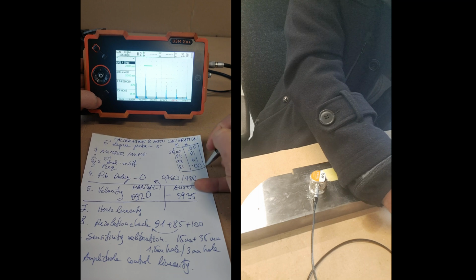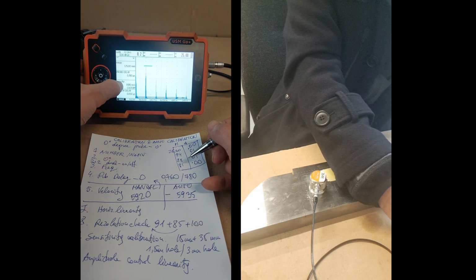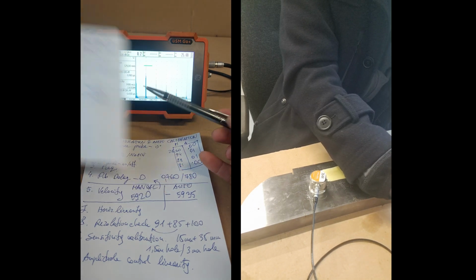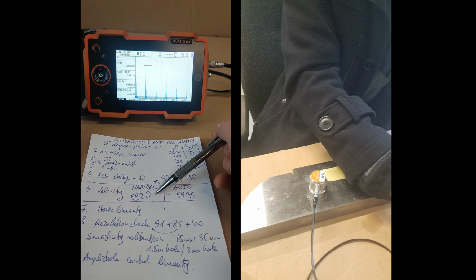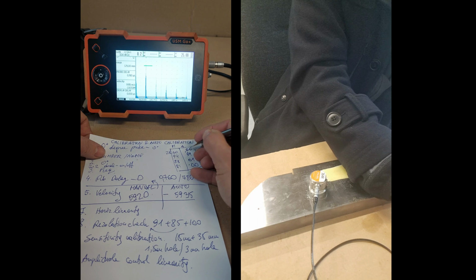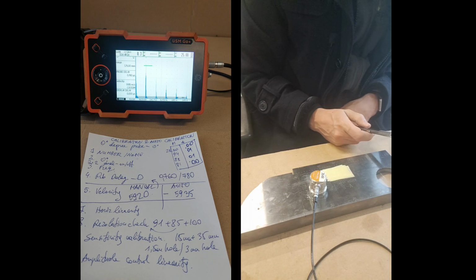That one you can do like this one, because it calculates both. It calculates for you, not manually, like velocity and probe delay. We set this, but it's plus minus something of the metal. This one is plus minus 30, so it made it 15 plus. That's not what I put in manually. And then it calculated the probe delay, and that is like, without anything at the end. Well, that's nice. That's a really nice result.